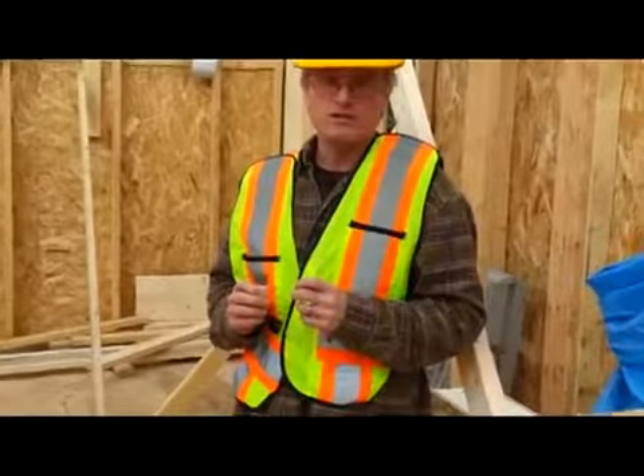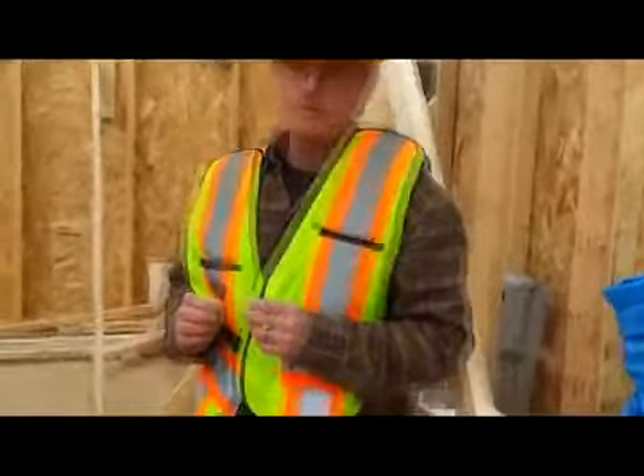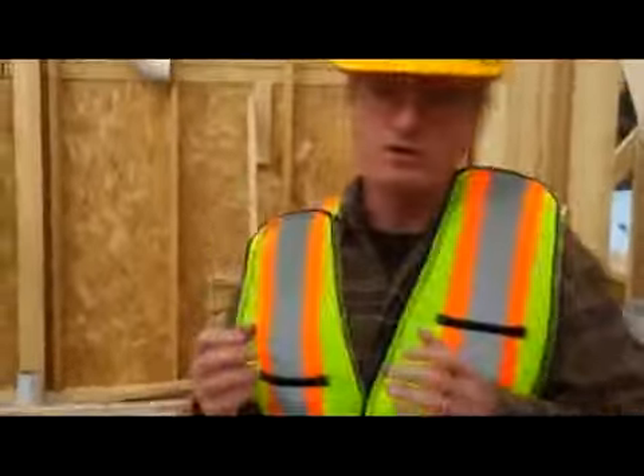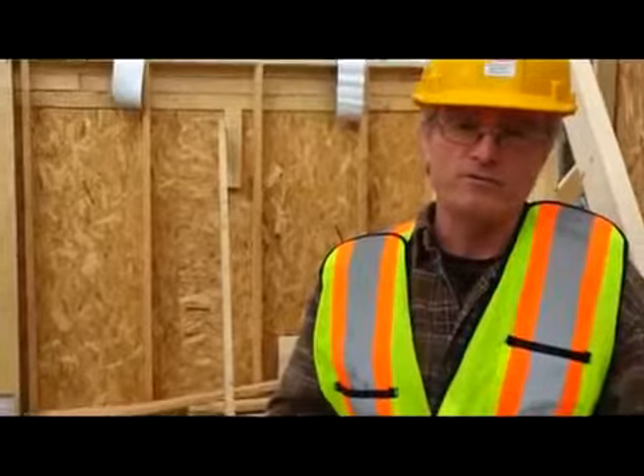We're at our Timber Ridge project. This is the next video in our series. We're lifting one of the main roof sections into place, and if you look over on the exterior wall there, you can see the sections of seam tape that are ready to go — to make sure that the underside of our SIP panel roof is properly sealed as it exits the building envelope, to ensure we have no extra air leakage at that seam, and also to prevent any moisture penetration into our SIP roof assembly.